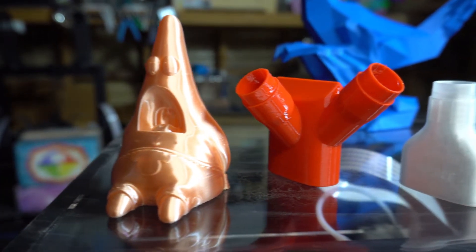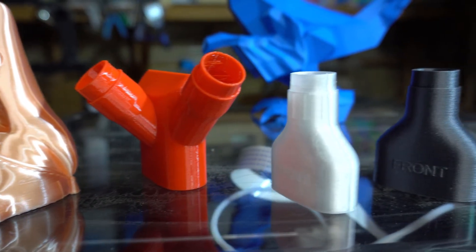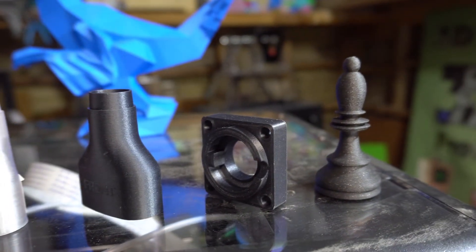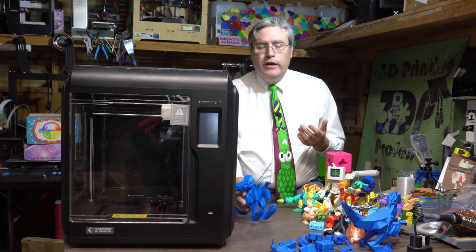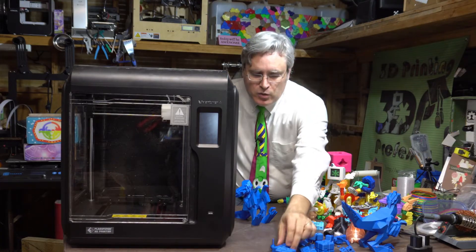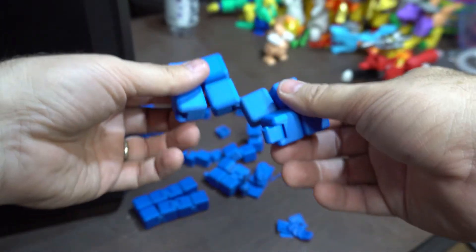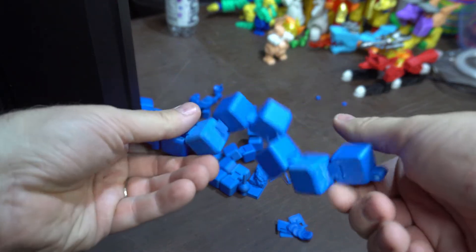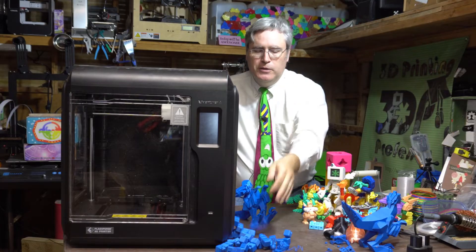They're creating a new nozzle for high-temp filaments. They sent me one that says it's a high-temp nozzle but told me not to use it because it's a beta unit and probably not good. But I'm going to be getting that and testing it out. I can confirm that nozzle wasn't good because whenever I get a 3D printer I do some test prints — one of them being infinity cubes — and at first I couldn't get them to work without breaking. Every single one I printed just broke. That one didn't even stick to the build plate.